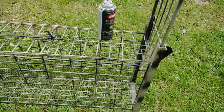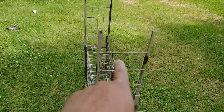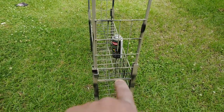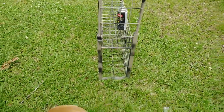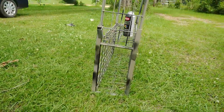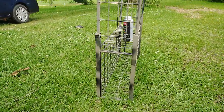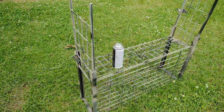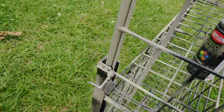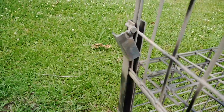It's made of two-by-four and horse panel — 10 gauge panel, so nothing's gonna break that. The doors are horse panel and half-inch cold roll, all the way framed up. It is eight inches wide, 17 inches tall, and 34 inches long. Each door independently locks using angle iron; when it slides down it catches down here.